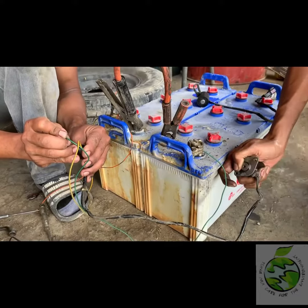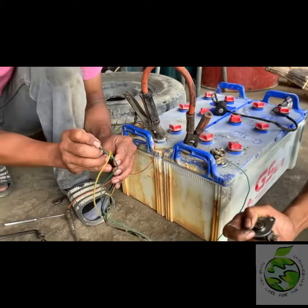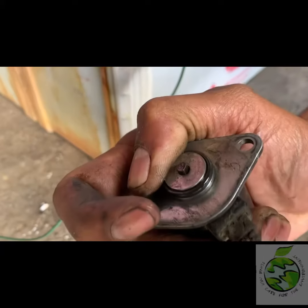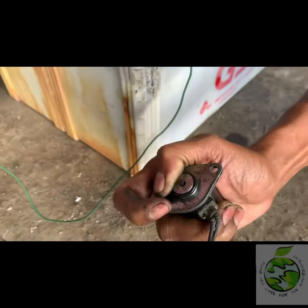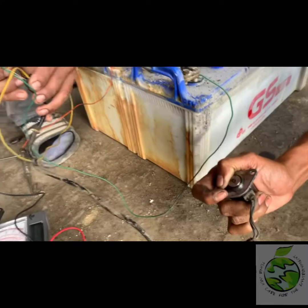This is how we're going to test the solenoid valve swing brake of the PC300-8. We put the power on pin number 2 and the ground on pin number 1.